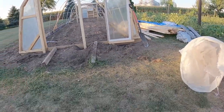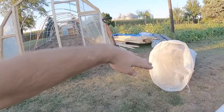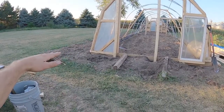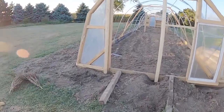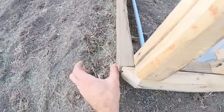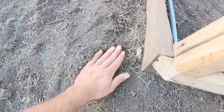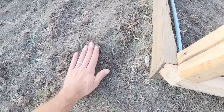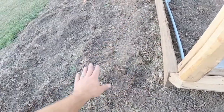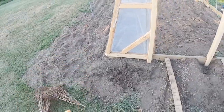That's why I ordered so much, and I had to order 28 feet to accommodate going around the whole outside of our greenhouse. Our first layer will be tacked down right to the wood frame, and then we'll have PVC running around the outside. The second layer of poly will be buried down into the dirt, and we'll mound dirt up on it — probably with hay bales in the winter time for extra insulation.